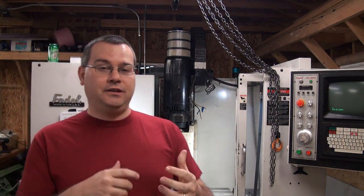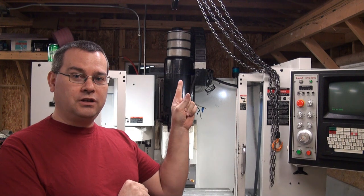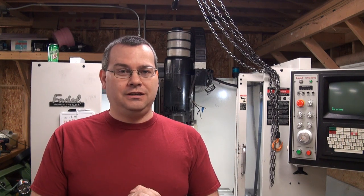I've already got a little bit disassembled. I'm going to cut in footage of other work to show the complete disassembly — taking the sheet metal off, the drawbar bridge, and all that. I also had to make an addition to the shop. If you look up you'll see some chains — I installed a chain fall and a unistrut trolley track. It's only rated for 300 pounds, but that's enough to get the motor up. The motor is about 200 pounds. I've also been handling steel jobs that are 100 to 150 pounds, so I'll use that for material handling too.